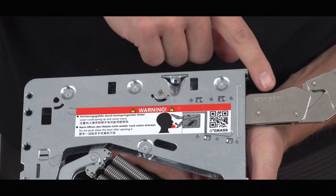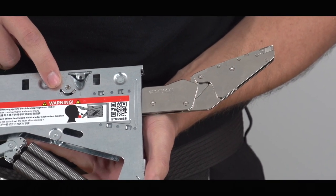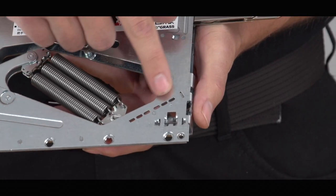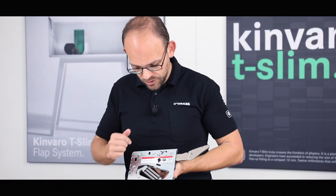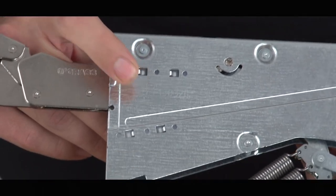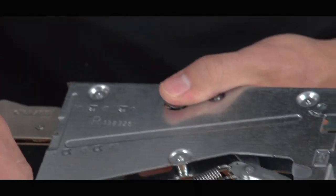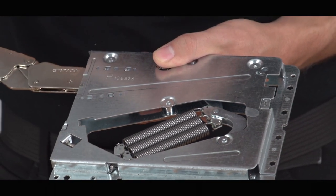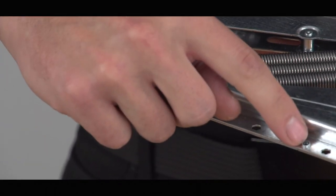We have here the screw for the integrated opening angle reduction clip, which limits the whole thing from 107 degrees to 75 degrees. Then at the bottom, we have the scale for the stepless spring force adjustment. And if you turn the whole thing over, we can see the letter R for right. We can also see this mortise, which runs along in a 90-degree angle, and two positioning pins, which are important for positioning both the milled version as well as the assembly adapter.